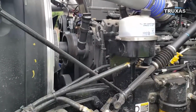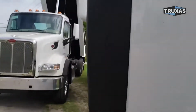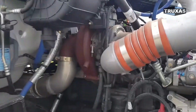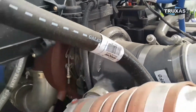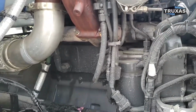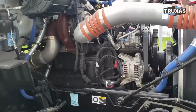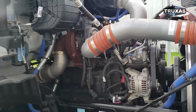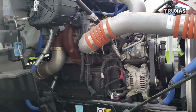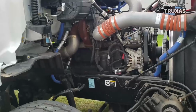If you look at a Cummins L9, which we have a video on comparing the two, they're basically identical engines. You can even see Cummins written right there on the turbo. So all these parts are Cummins parts. This engine weighs about 1,800 pounds less than the X15 big block. And then the MX-11 is probably 600-700 pounds less. We're actually doing some weights on that. You can look at our MX-11 video, and we're going to post some of the weights there.